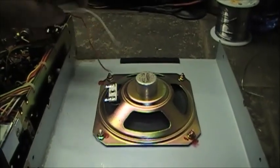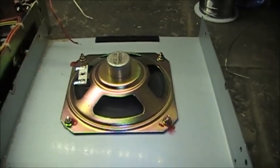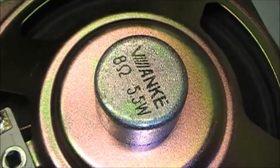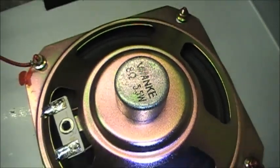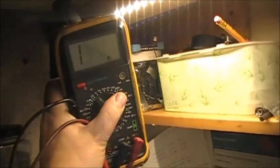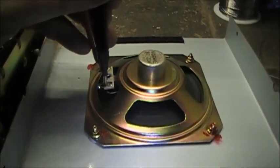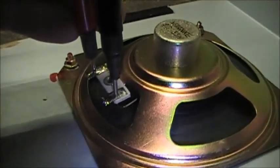OK, so I had the speaker wires disconnected. The first thing we're going to do is check the speaker to see if it's any good. It's one of these Vankey — or Ankey — whatever, 8-ohm 5.5-watt speakers. So we're going to try and see if we've got 8 ohms with our multimeter, set to 200 ohms. This meter here doesn't have a backlight, but let me aim it so you can actually see it. I'm going to put one probe here and one probe there, one on each side.